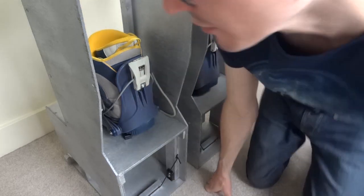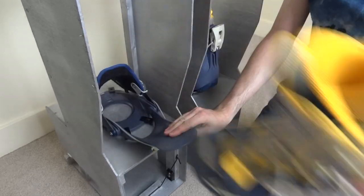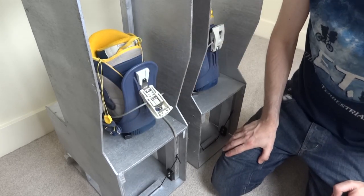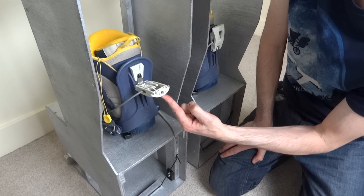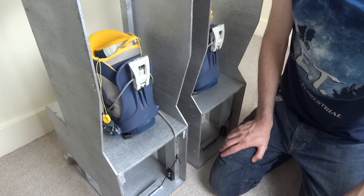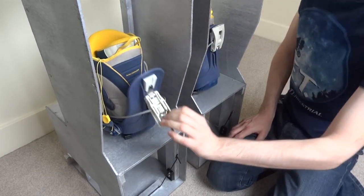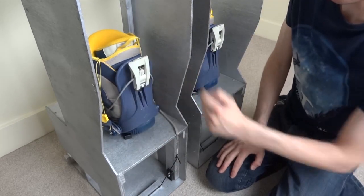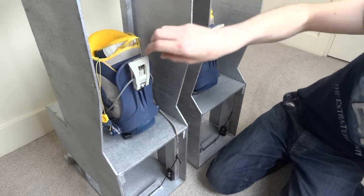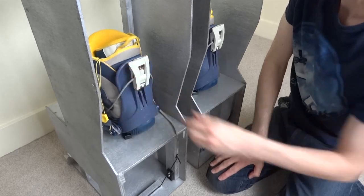Let's have a closer look at these snowboard bindings. What we've basically got is a latch that latches at the back and then the boots can come out. I can't bend down to reach these anymore with the torso on and my body in it, so what we need is something fairly simplistic that pulls this up and latches into position, and then another way of remotely pulling it down again. If we pull directly down it's not going to work very well - we actually need to pull it out and then allow it to be pulled down. I think the best solution is to make a mechanism that pushes this white piece away from the blue back piece like so, and then it should flip open - that should be fairly easy to operate with a cable.